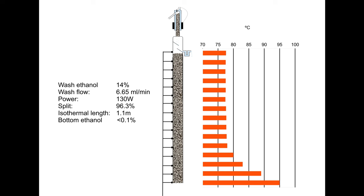The sensors I use are generally precise to within about a degree and so enable reliable determination of where the transition between this lower section of the column and the higher isothermal section is. The length of that isothermal section is a parameter that can be used to control the column. I have found that if the column is uninsulated, then spirit proof is slightly higher because of increased reflux, but there is a greater temperature differential between the centre of the column and the surface thermometers. I found this to be 2 to 3 degrees with a 28mm diameter column.